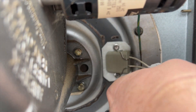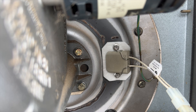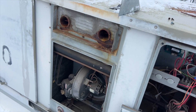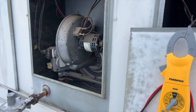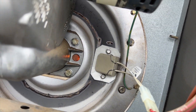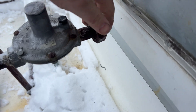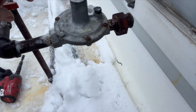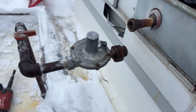Now we're going to go ahead and power it up and call for heat and see what happens. Just going for heat. I did see the inducer kick on. Pulled that off — I got nothing. So either this thing is frozen solid or someone didn't pay the gas bill. I'm hoping it's just frozen solid.